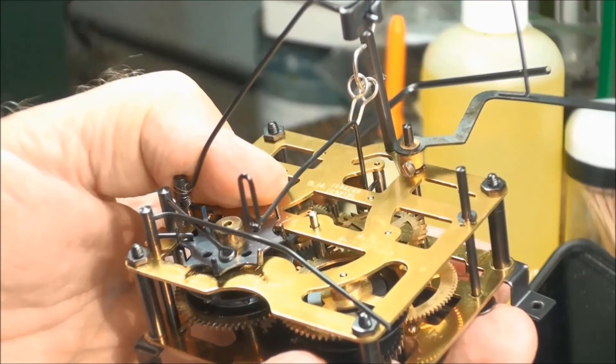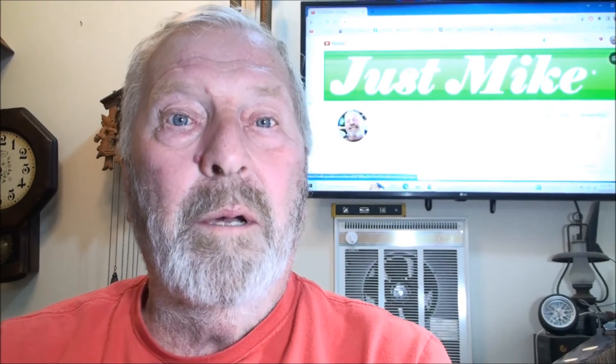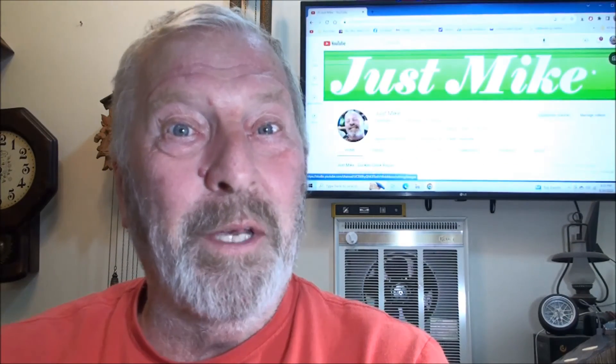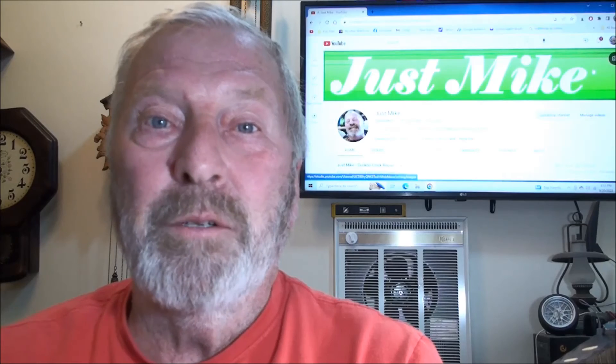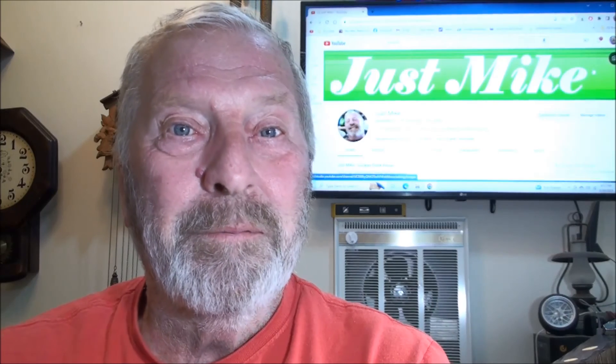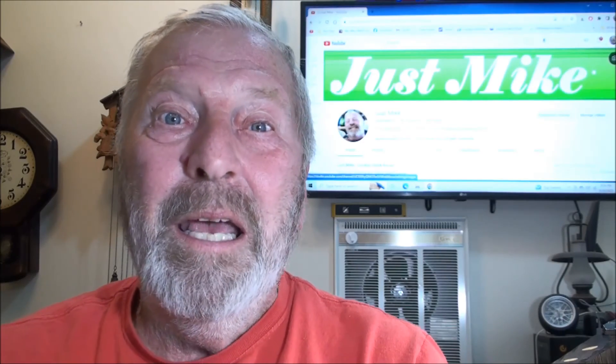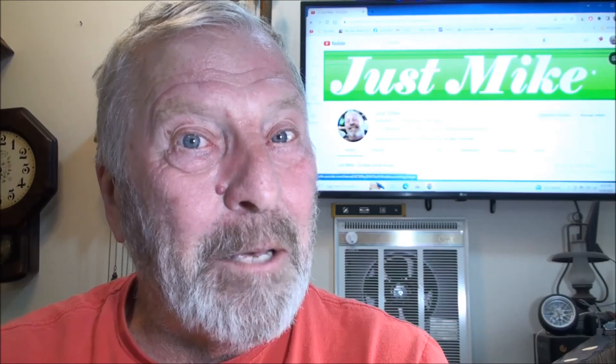There it shut off. I'm going to hold this so it doesn't wind backwards on me. What I'm looking for is this needs to go coo, or dong, coo, coo. Once it hits that coo, tighten your screw so it'll be in time, then test it again. I have to put the screw back in. We do have a part two on this video dealing with the music box, cleaning the parts for the dancers, and then we're going to get this clock back together and working. Until next time, don't forget to subscribe — it's free. Give me a thumbs up, and God bless.